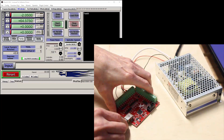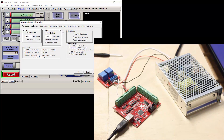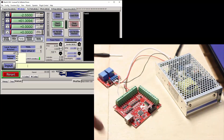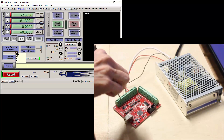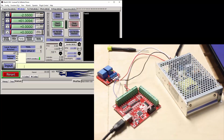Now we can test if it works. Plug in the controller to the computer using the USB cable, then plug in the 24-volt power supply. I also need to change the configuration back, since I was using output number 4 before while testing with the multimeter. Let's try turning on the first relay. The first relay turning on is verified by the red LED — the relay also made a click sound. If I type M5, you will see that the red LED will turn off. Now let's put IN2 from the relay to output number 2 on the controller using a blue wire. Plug everything in again. I will type M3 to make sure output number 1 is still working, and then type M4 to test the other relay.